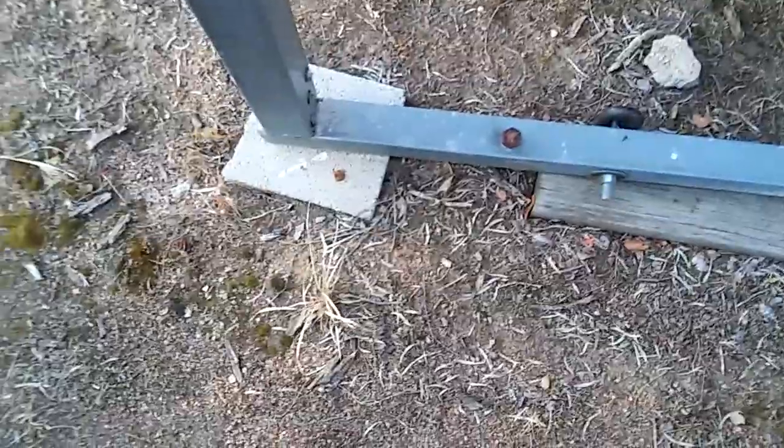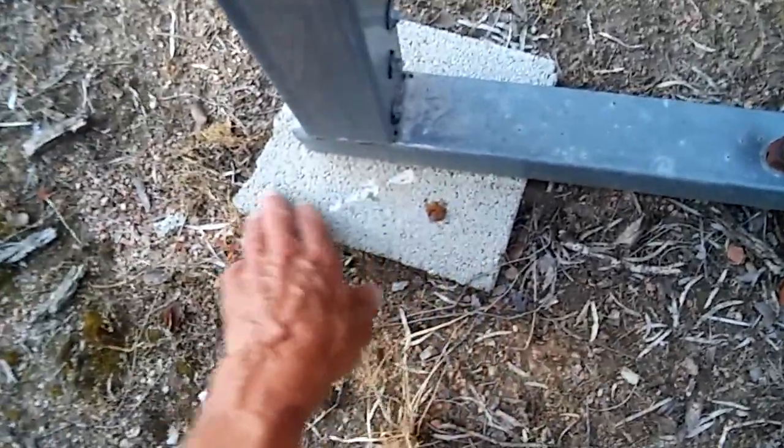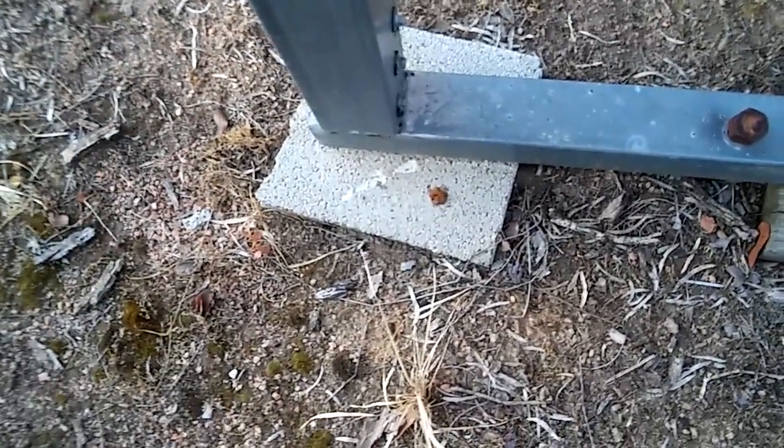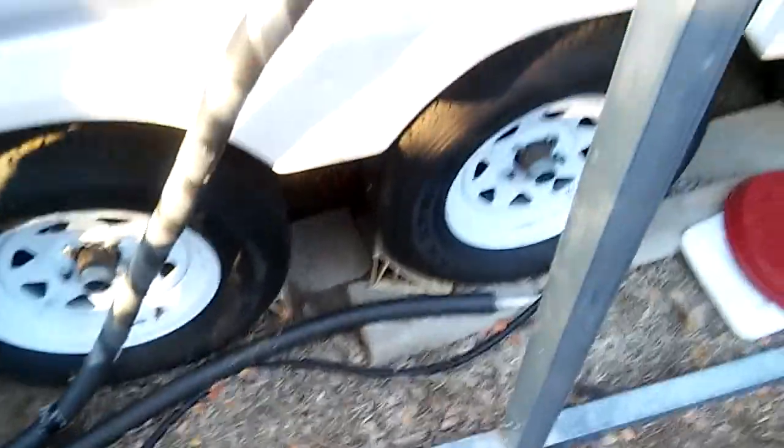For leveling the carport, I had a lot of these concrete blocks - this is just half of one. You can buy those at the hardware store for about a buck and a quarter each. If your lot is not level, they'll take a hammer, hit the block in the center, break it in half, and use the pieces to level up. I've got one under that leg, and under here, and the rest of the legs don't have one. They are excellent at leveling.